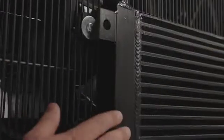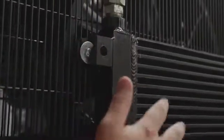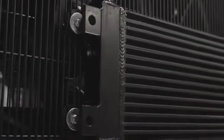One of the other things you're going to want to look for on your compressors is a belt guard after cooler. This is an after cooler that's mounted outside of the belt guard, as the name implies. The air runs through this and is cooled down before it enters the tank, which prevents moisture from building up in your lines and also in your equipment.